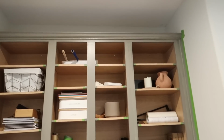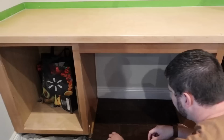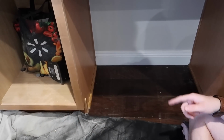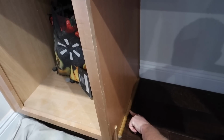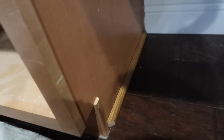We have the first coat on up top. We have the second coat of poly on, and Kyle's working on this quarter round. That'll look really nice with the angled cut. The floor is very uneven right there, like it's not finished. So Kyle's just putting in a piece of quarter round. It's actually leftover from when we just did the bathroom. And then he'll attach this just with a nailer. And then I'll end up just painting this the same as the cabinet, so it'll look seamless.